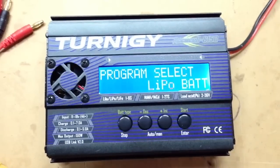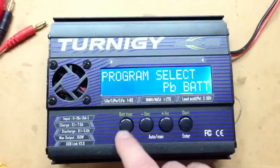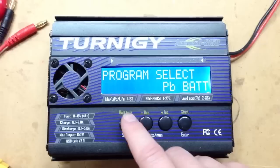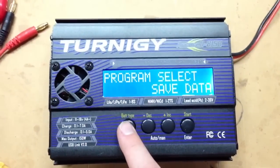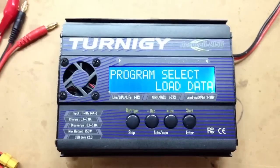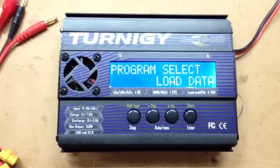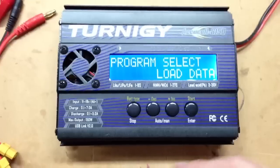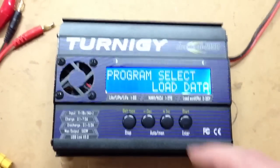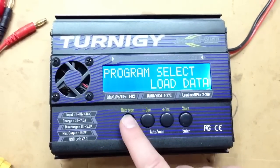All of these battery types work the same way. We've got nickel metal hydride, NiCADs, and lead acid batteries — I charge my trailer batteries with my big chargers. You can also save data or load data, which is handy. I've got a lot of Gen Ace 450 milliamp hour 3-cell packs — little guys for indoor/outdoor flying with my EPP planes like my Twisted Hobby stuff — and it's really nice to just store those settings and hit go.